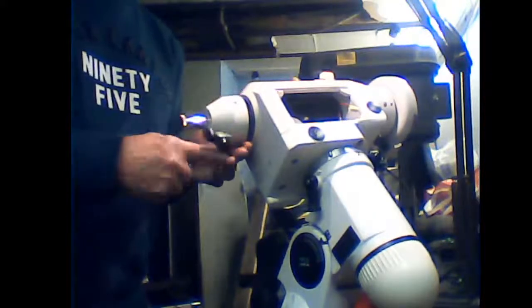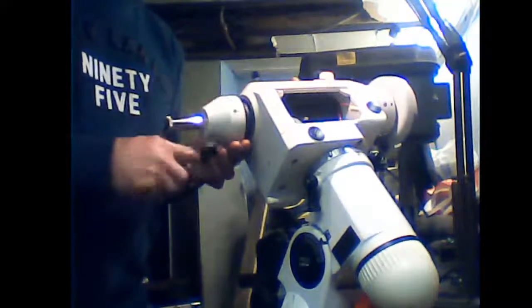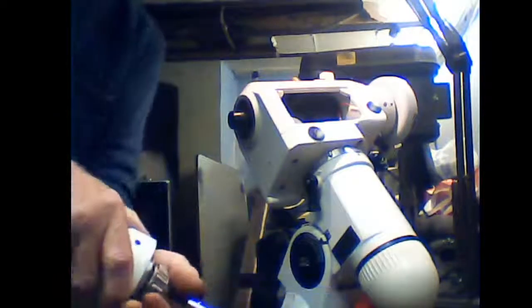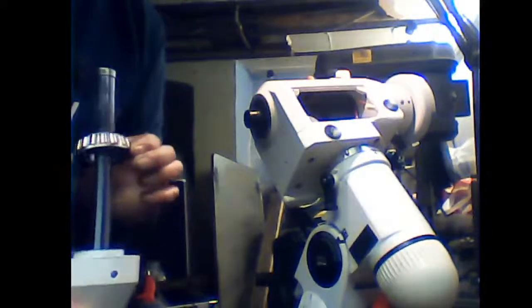In there you'll find taper roller bearing, okay, that will just slide out of there. I'm hanging on to this because inside this cap it's a grub screw. Why there was only one in there, I have no idea. Obviously when this mount was modded, someone failed to put them back. Bit of kitchen roll. I'll just put the bearing down there.